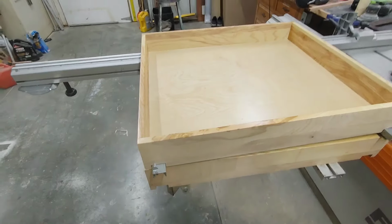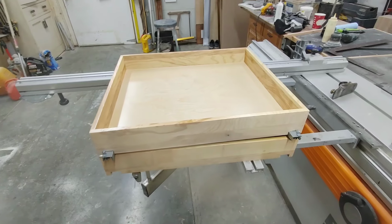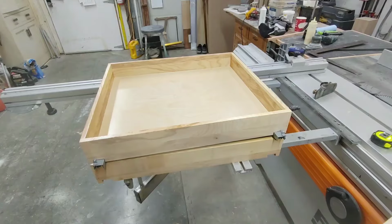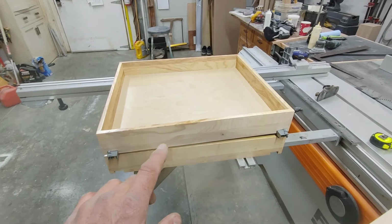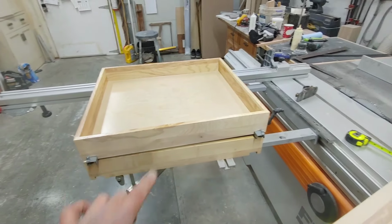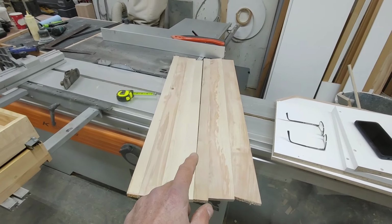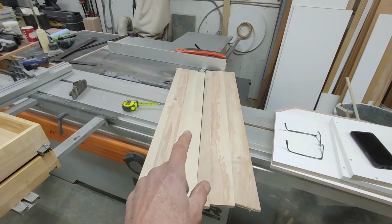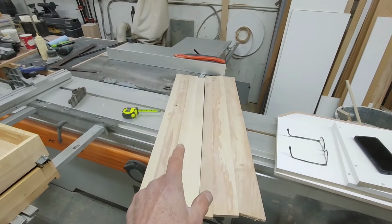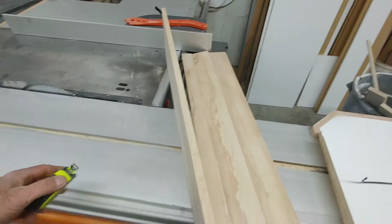But here's the thing. I can't make these things if I have to pay the commercial rate for lumber. So let's say even birch is $3.50 to $4 a board foot. I just can't make enough money to produce drawers at a proper shop rate. So I need to get material cheaply. So with this ash, it was basically a tree that I had milled, and I had them mill it to a certain size, and then I cut most of these pieces myself to 3/4 thickness. But then I milled everything down after it was glued and made it 9/16.